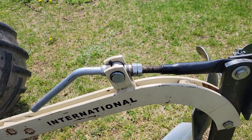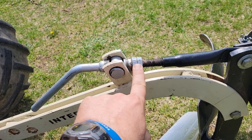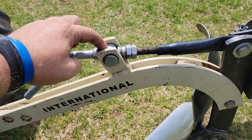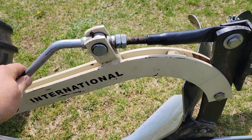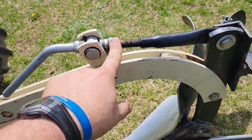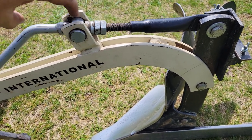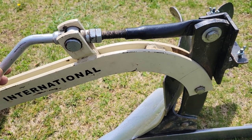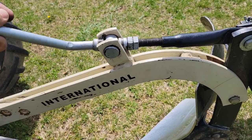If you see how this one is set up correctly, both nuts are here at the front and they're locked together — that's the way they're supposed to be. There's a little bit of slack here, a little bit of space, so that this can spin freely. Having these locked together makes the crank turn but keeps it from moving back and forth in this trunnion here.